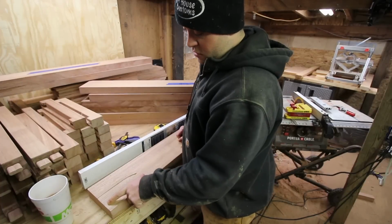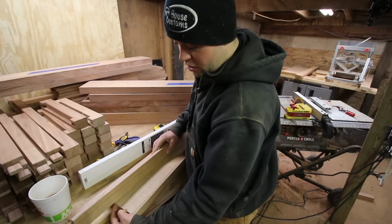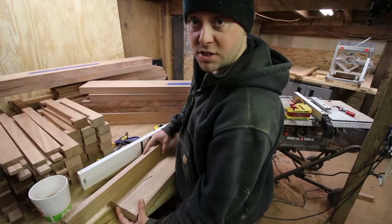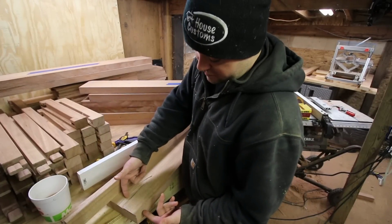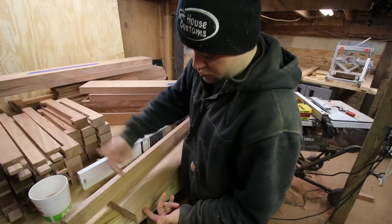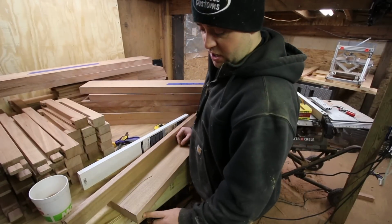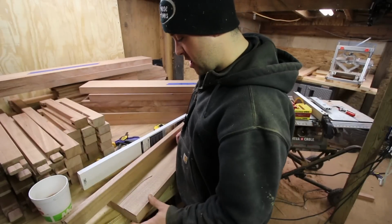So I got that 1 1/4 inch mark, and then I went in another 1/2 inch. From that extra 1/2 inch, I went over another 1 3/4 inches, which is the thickness of my window. And then that total distance that I have right here is 3.5 inches. So now from that 3.5 to wherever it is, I need to rip that on a 5-degree. So I entered it in my calculator, did some math and stuff, and figured the difference was 5/16 of an inch on that 3.5 inches.